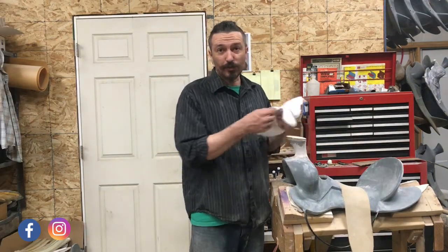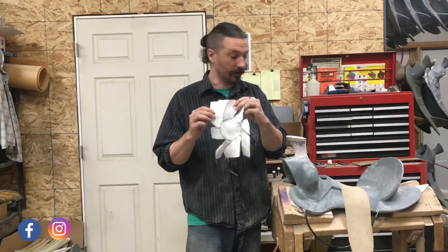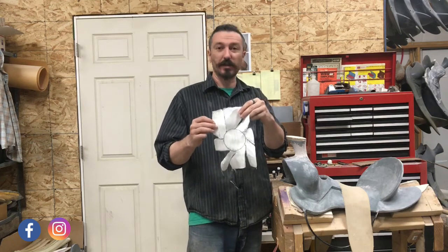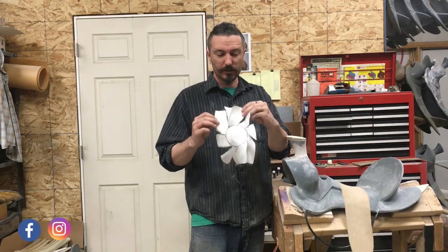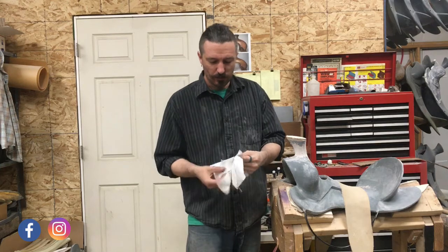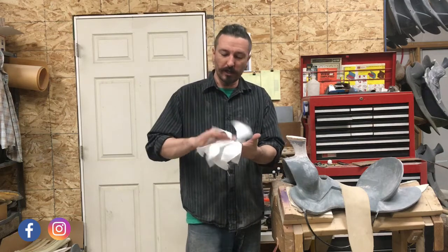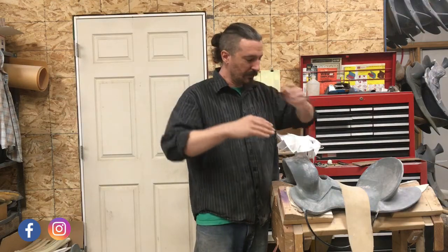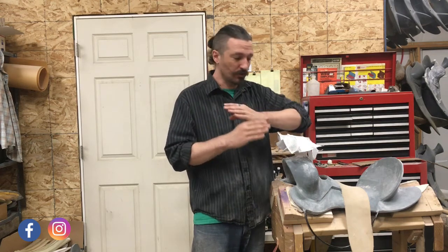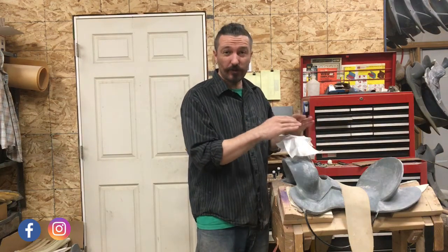All right, we're back, and I've got my two pieces of fiberglass. Now, I've marked the center of the fiberglass with the horn cap size. You can see it's a 6x9 rectangle with angled spokes cut around it like a wheel. The reason is that when we laminate these pieces to the horn, one will go in another direction so that it's laying this way and this way on the horn. But the cuts will be going crossways, so it's going to make an artificial bilateral weave, which will be very strong in the end.